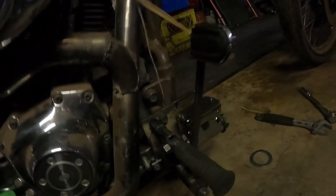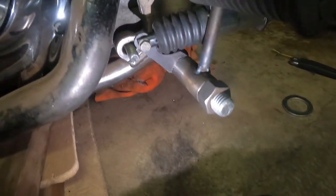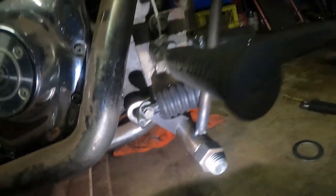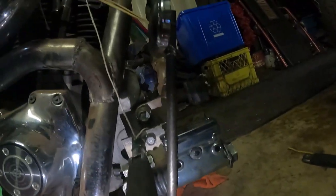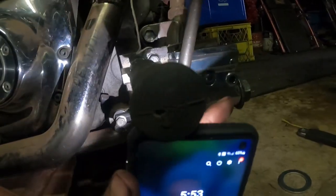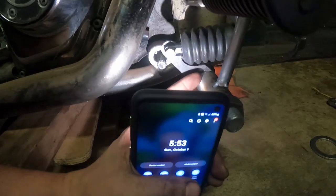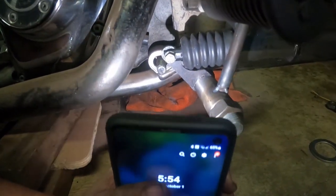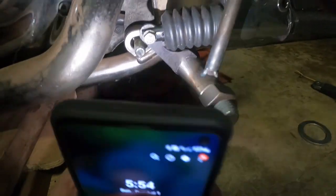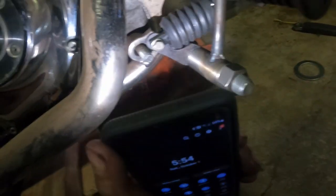Let's just see what it looks like. This is just an elastic band because this arm isn't secured yet. Let me get the flashlight out for you guys. You can see that arm isn't tacked into place — that's why I have the elastic band on the pedal. But you can see when that lever goes down like that, it's going to actuate the pump or piston that pushes brake fluid through the brake lines. I'm just going to mark it here and here and do a quick trace, then start tacking it up. It's going to look a little industrial with a giant bolt on the end, but as long as it stops me, I'll be happy.